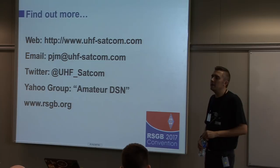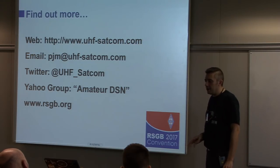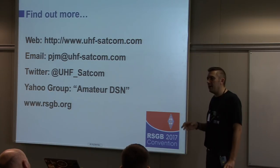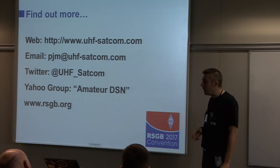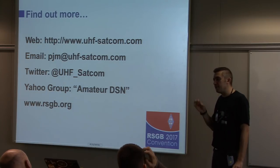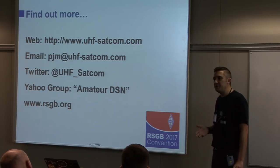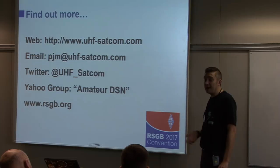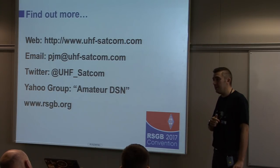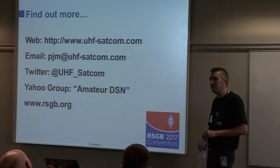Could you give us some details about the dish — it looks like a petal dish? The dish is a Ku antenna made by NEC around 1985 for their first home satellite TV receiver. It is six petals — you don't really see them too often. Most petalled dishes now are very thin aluminium sheet, but this is about 3mm aluminium plate, fairly heavy duty, and it's kept its profile. I was given it in the 80s — it was stored on a pallet in a wooden box so it wasn't damageable. It's a heavy-duty sat TV antenna from the good old days.